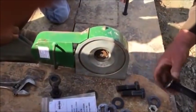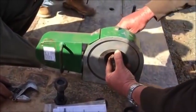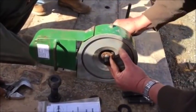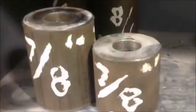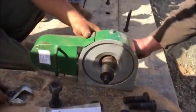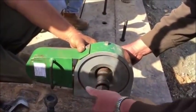Three DTIs for each lot for each size bolt shall be field-checked in the device. Bolts for this test should be of sufficient length so that three to five threads are located behind the bearing face of the nut. Additional washers may be required. Spacers may also be used in lieu of hardened washers. Remember, as the nut turns, you're going to need threads. The bolt also should be of sufficient length to fully engage all of the threads in the nut.